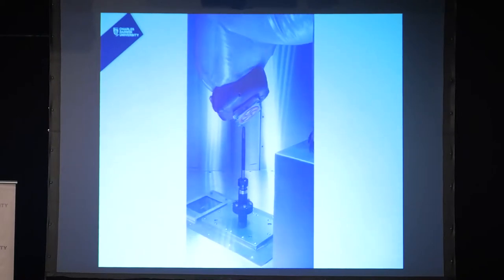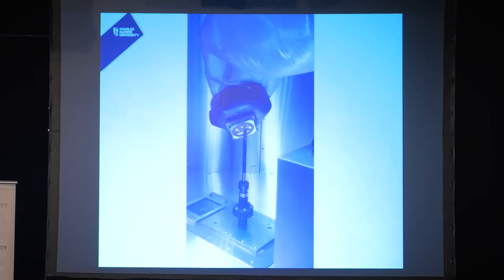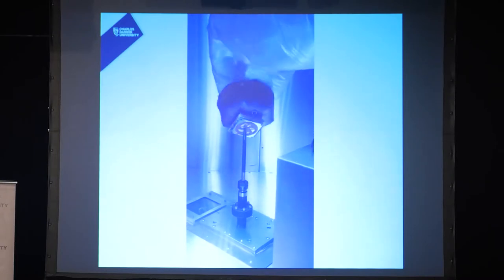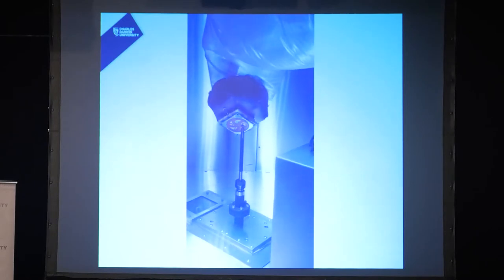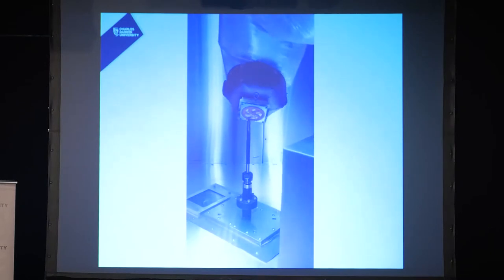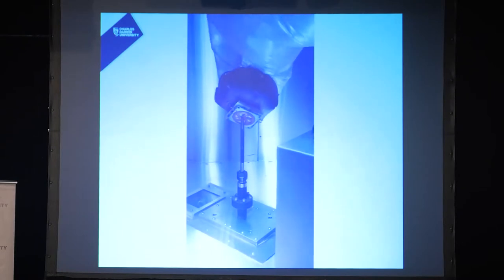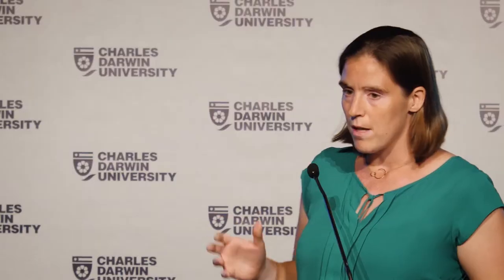Basically, down at the bottom you can see a nozzle. In there you just have metal powder — copper powder that you feed through. You heat it up to about 400 degrees, so you don't melt it. You have a lot of pressure behind it and you're shooting it through a jet engine, pretty much, speeding it up to three times the speed of sound. The extremely clever part is the robot arm at the top — it's programmed to catch that metal in the right pattern to build these layers. Cold spray has been around for about 20 to 30 years, found in the 80s by Russians, but they were never able to unlock it for three-dimensional shapes. Using this software and this robot, being able to catch it like that has unlocked this technology for complex three-dimensional shapes.